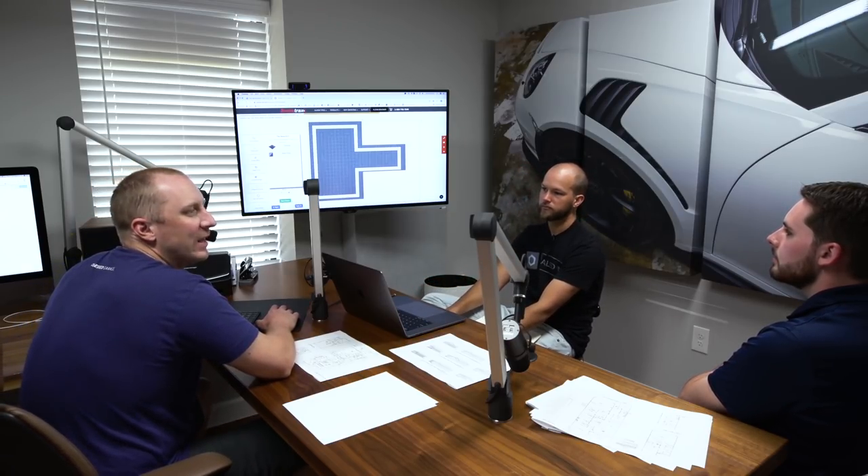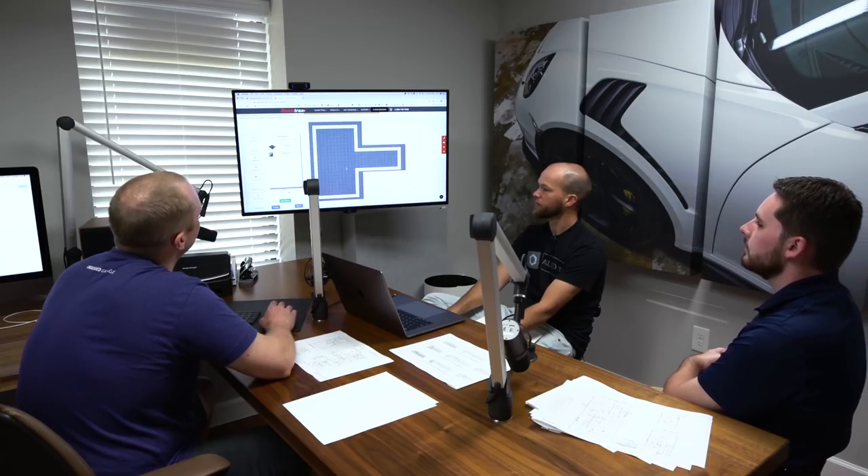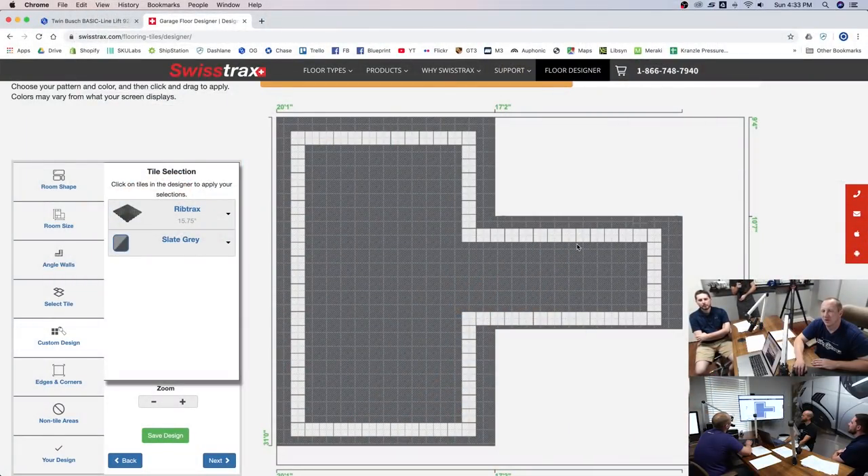You would lay it out symmetrically — you'd cut these so it was somewhat symmetrical. Out here it won't be perfectly symmetrical since you'll have cabinets and other things. When you start to float the floor, it'll all be floating and you'll have all the edge pieces not connected. At the end you push the floor one way or another and figure out where to cut in order to get it as symmetrical as possible.